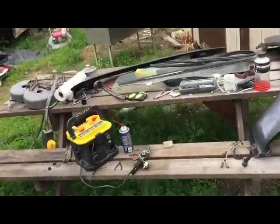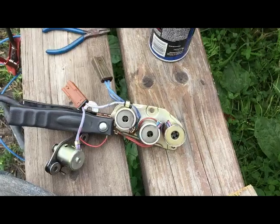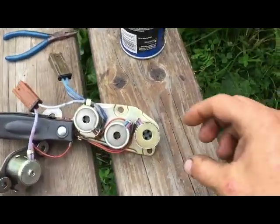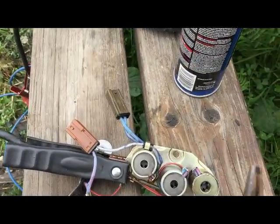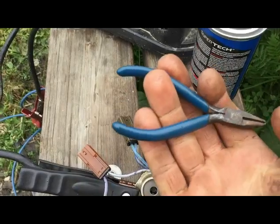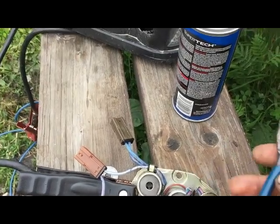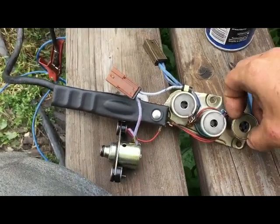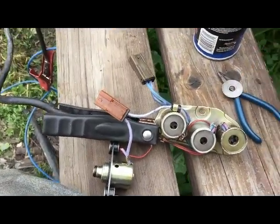I have one of these solenoids torn apart here, so we're just gonna open this up real quick and show you what's inside. All I did is I opened up the lip. I used a special pair of little pliers — a blue-point pair of pliers — that work real good for doing this. You just take two laps rolling this open and then you can fold it back. The only thing that's gonna stop these things from working or not being cleanable is having no continuity in the coil.